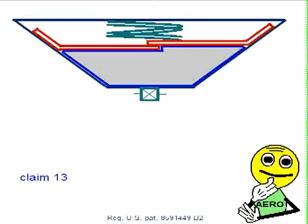So as you can see, by expanding the surface of the partition by pressing on it with the hydraulic fluid and moving it nominally upward, we compress the spring because we have expanded this surface and we have a fluid acting on that surface. So the total amount of force acting on the elastic material gradually increases in step with the compression of the elastic material.